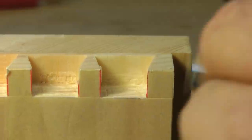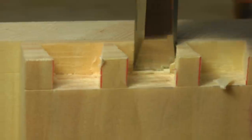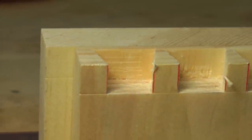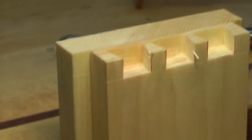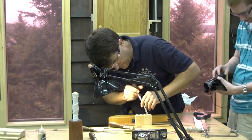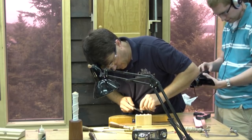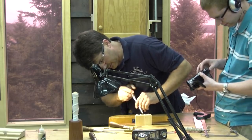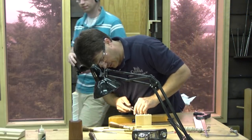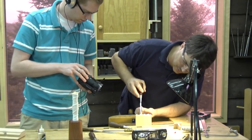So as the last thing you do before you leave the joint, there's one over there too. Now let's double check, make sure we don't have any little bit of ridge left on that one. None there. Oh yeah, there is. Oftentimes you can't see it, but you can feel it with the chisel. So you've got to come in and do both those tests.